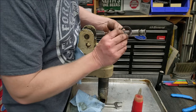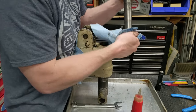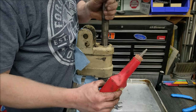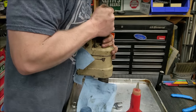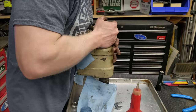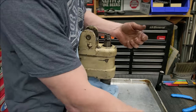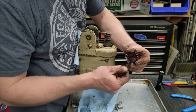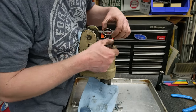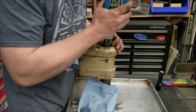With the spacer and U-cup installed down in there, we can take our main hydraulic ram and slide it in — that's a nice tight fit, which is what it should be. At the top, most hydraulic rams have a double lip seal, similar to what you'd find on an axle. It prevents stuff from going in and out but mainly acts as a wiper to clean junk off the ram. This particular one has a snap ring, so we'll throw that snap ring in.